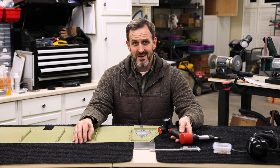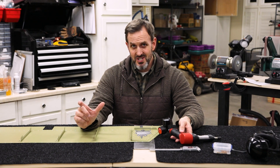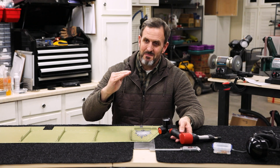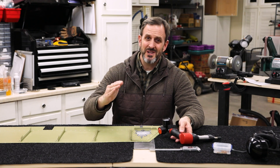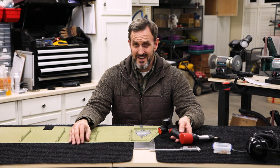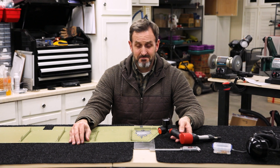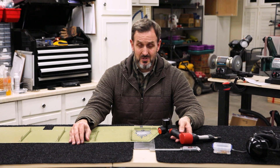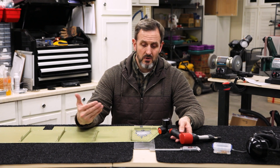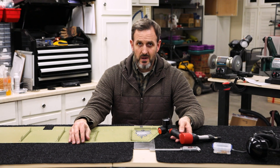The manufactured head side — the flush side — looks absolutely beautiful. Last time I was happy with how the horizontal stabilizer turned out, but based on what I've seen on my practice sheets, the manufactured side looks really really nice. Now I look at my horizontal stabilizer at the rivets I set with the rivet gun and I just kind of cringe. Maybe I just sucked at riveting, or maybe that's how it's supposed to look. Regardless, I'm going to back rivet these in and see how it goes.